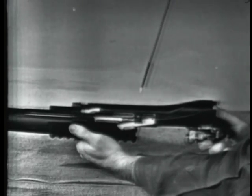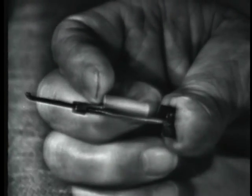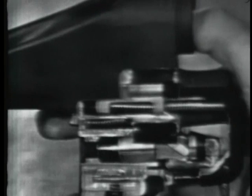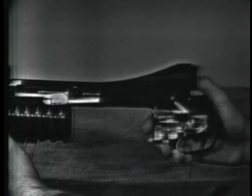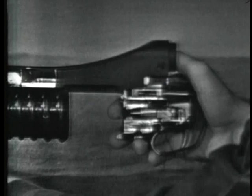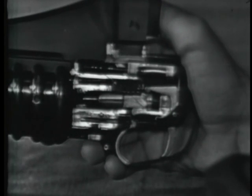When the barrel moves fully forward, the barrel extension is moved out of the trigger housing. The barrel extension follower, which is spring-loaded, follows the barrel extension and serves to hold the cocking lever down when the barrel extension moves forward and clears the cocking lever. Without a barrel extension follower, the barrel extension would jam against the top of the cocking lever as the barrel is moved rearward. By holding the cocking lever down with the follower when the barrel extension is moved into the receiver, the cocking lever will again enter into the elongated slot of the barrel extension.